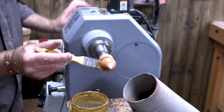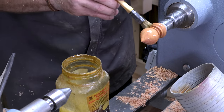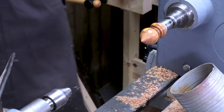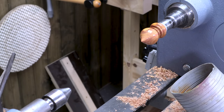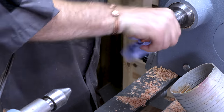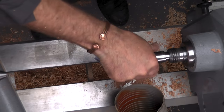So to polish it and seal it, what can we use? This is going to use the cellulose sealer. So we use this quite a lot. That brings the colour out. So that's thinned a little bit. Grab a little bit of blue paper towel so we can dry that off. Okay, quickly just friction dry a tiny bit.